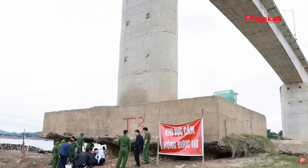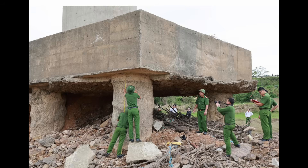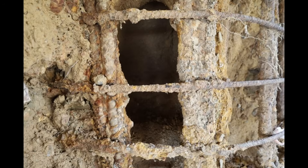Due to recent flooding in Vietnam, there was scour around the bridge pier. After the water receded, locals discovered back on October 27th, 2025 — I'm recording this video on November 8th, 2025 — that the drilled shaft foundations were in very poor condition. The upper portion of the drilled shaft foundations were exposed and the concrete was very poor quality. There were inclusions of soil and the reinforcing cage was exposed. Very poor quality construction.